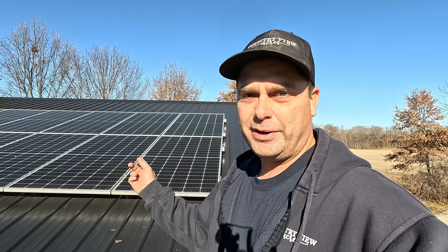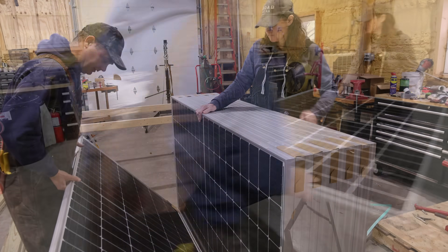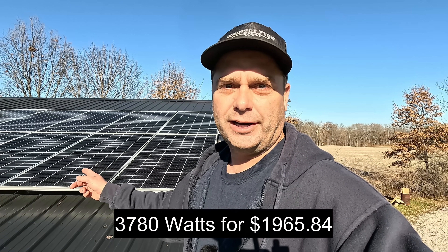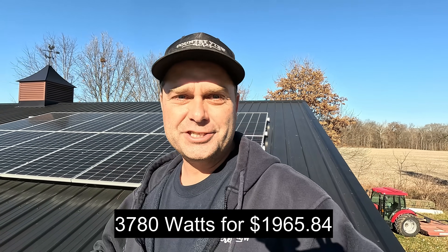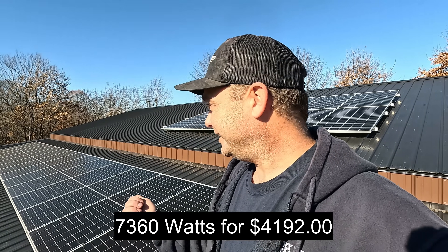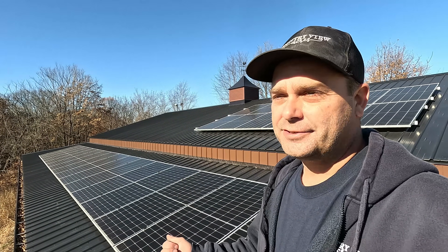If it was 200-amp-rated equipment this would have been well over a thousand dollars. Now for the solar panels — I actually have two different sizes because I bought them at separate times. The first set was 315-watt panels; I bought 12 of them for 3,780 watts total at 52 cents a watt from Signature Solar. When I went back to buy more, those were sold out and discontinued, so I bought 460-watt panels — 16 of them, 7,360 watts, at 57 cents a watt. We ended up with 11,140 watts of solar panels costing just over $6,000.